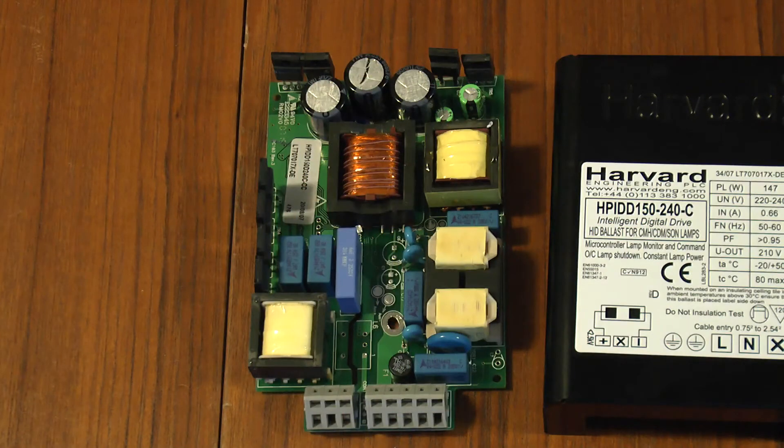Top side we have all the big stuff. There's a couple of transformers and a few capacitors. Starting clockwise bottom left we have four P16NS25FP N channel power MOSFETs, a P20NM50FP which is another N channel power MOSFET, an STTH8L06FP high voltage rectifier diode, a YG971S6 which is a high speed rectifier diode, and finally a P9NK50ZFP which is yet another MOSFET.